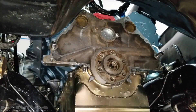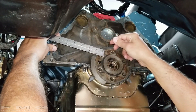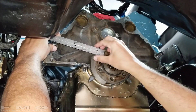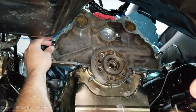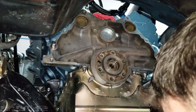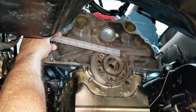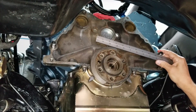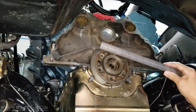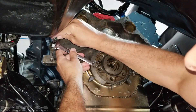To help with alignment, I got a straight edge and put it right on the wrench flat. It's kind of pointed down a little too far, so we need to be at more of that angle - just take the wrench and move it a little bit. I think that looks a lot better and we'll do the same on this side, using the bottom flat. Once that looks good, I'm going to lock them down with the spanner wrench to keep position, and use the allen wrench to tighten.